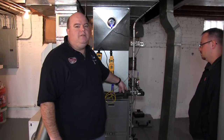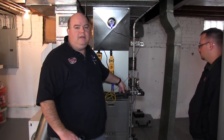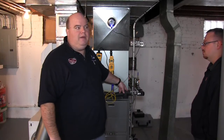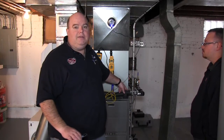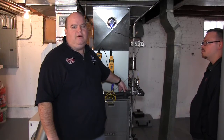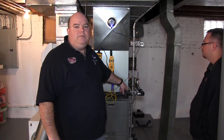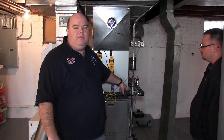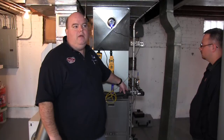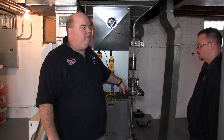Now there's a 110,000 BTU 80% furnace in this house. I just went through one of the coldest winters with it set at 72, and it never had a problem maintaining that. What that tells you is a lot of stuff in this area is way oversized - you do not need a blast furnace in your house. This particular house has been upgraded and renovated a bit - it's got new insulation, newer windows. It's an older brick house, but the windows and insulation were all upgraded when I was doing work on it before I moved in.